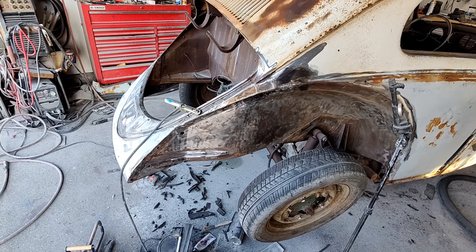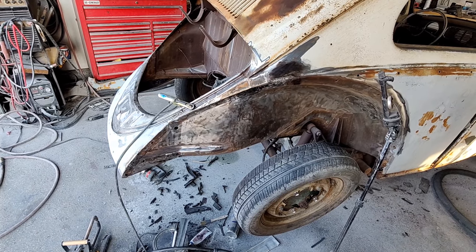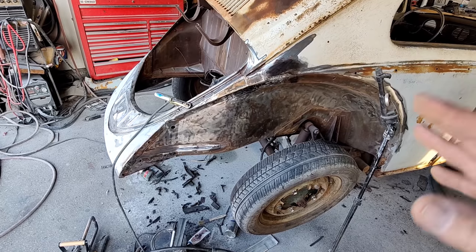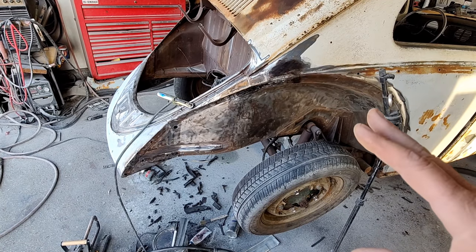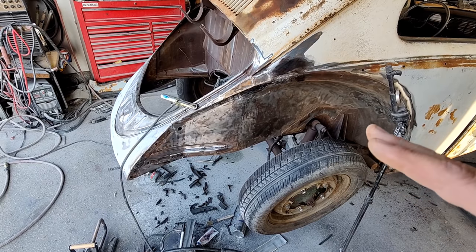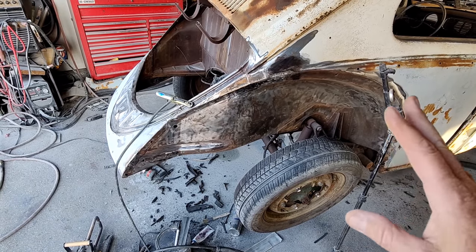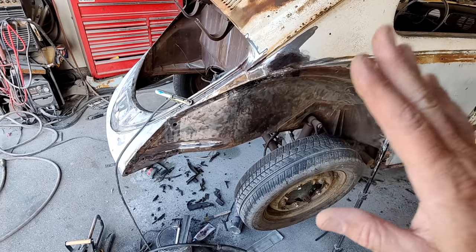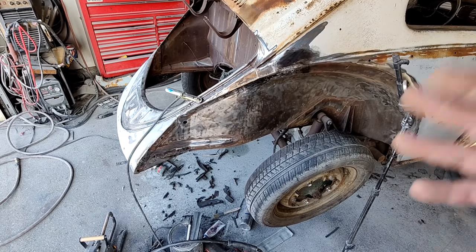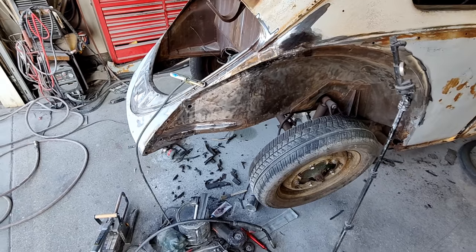I've noticed some guys are adamant that you've got to put the filler over bare metal. I was that way, until recently they've come out with fillers that actually adhere to the epoxy primer. But the thing is, I've seen so many people do it, they don't sand it. You have to sand it really, really rough. So if you're going to put epoxy primer down first as a bed and then go over that with filler, you can do it, but you really have to know what you're doing. You've got to make sure it's really rough sanded, and you have to use the proper filler that sticks to it. So I use the AG47 and spec to go over sanded epoxy primer. Got to read the specs on everything you do. If you do it wrong, you'll be doing it twice.